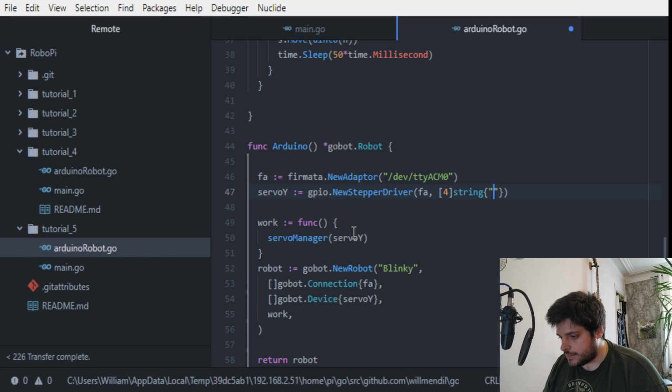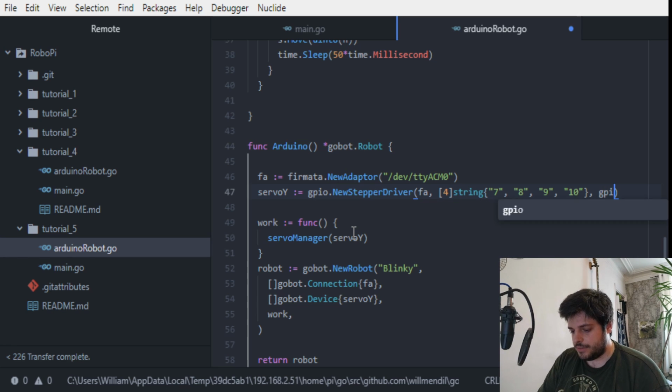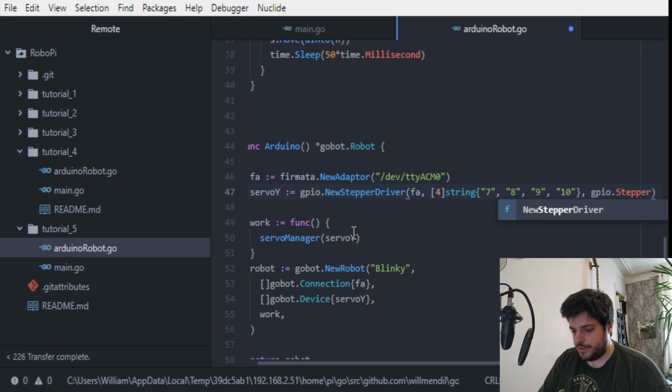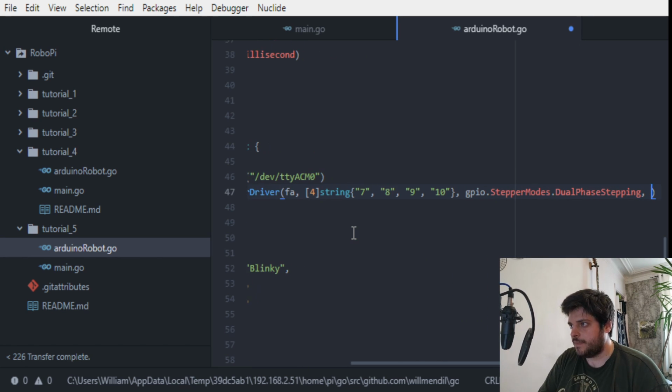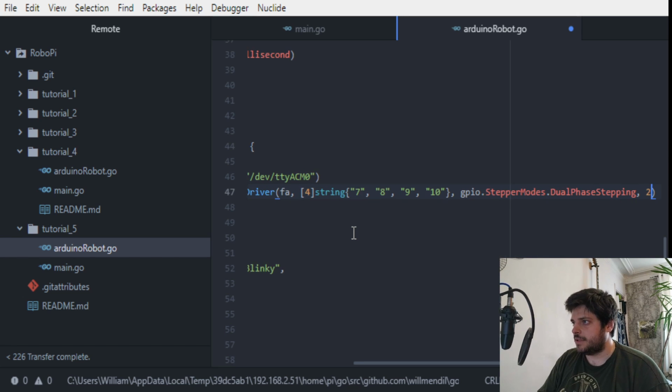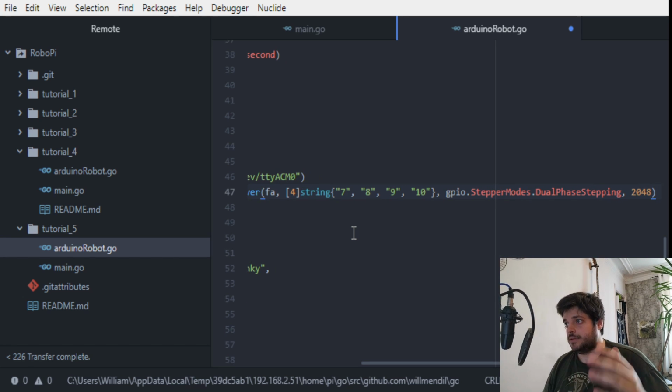So we are plugged into pin 7, 8, 9, 10. Then we give it the phase of the motor. In my case, I'll put in the description the type of motor I'm using, but it's a dual phase. So we put GPIO stepper mode, dual phase stepping, and finally the number of steps to make a full revolution, which is 2048. This is according to what I found online. I'm not actually sure, but it worked.